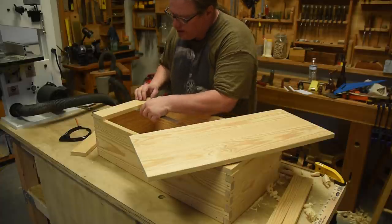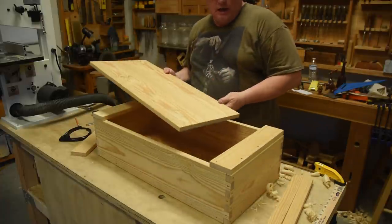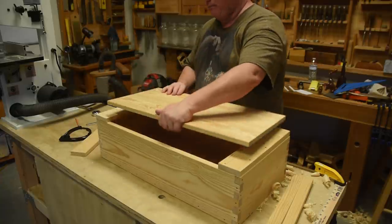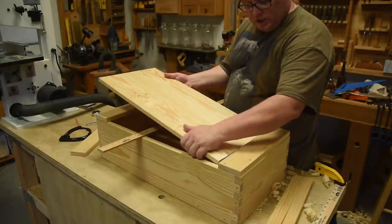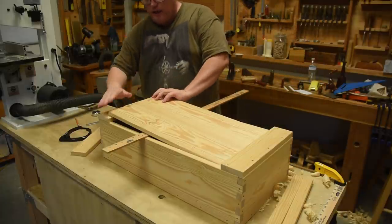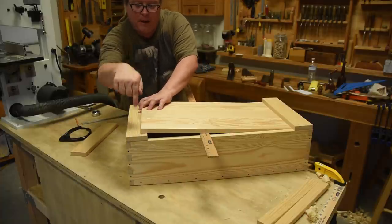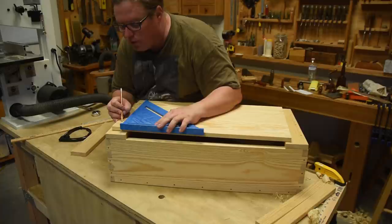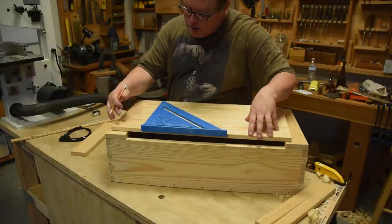Each side has about 2 and 3/8 inches of overhang. We're going to want to slide these boards underneath and be able to drop it down. Grab a yardstick, drop it in, slide the board all the way back, rest it on the yardstick, and that way we can measure exactly where this needs to be in order to pass past the board. Then marker line, saw line. Because these don't have to be perfectly square in this setup, I'm going to cut that on the bandsaw.